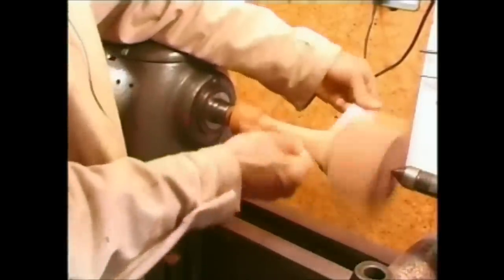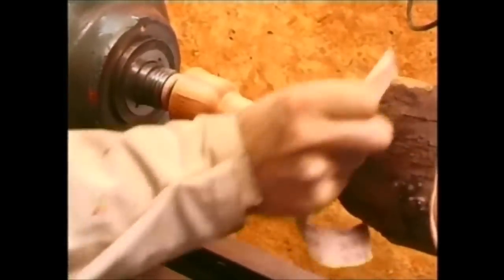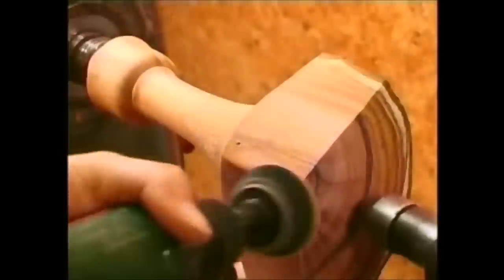Strip sanding with a piece of aluminium oxide flexible cloth-backed abrasive is remarkably quick. It is no respecter of detail and can even ruin your smooth curve if overdone. Take care not to round over the edges. Though they do not want to be sharp, they look better if they are deliberately rounded than if they just get sanded out of shape. Stop the lathe and hand-sand the wings — you could also use a foam drum for this area. I have started with 150, and am going through 240 and 400 grit sizes. This is quite fine enough for yew wood. For the final finish on the sawn sides and the base, I have mounted a foam drum in the headstock. Smooth out the saw marks and go to a finer grit. Once the surface is good, softly round all the edges.